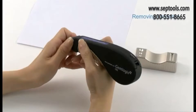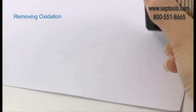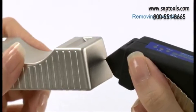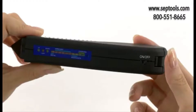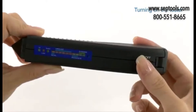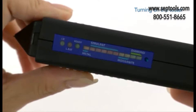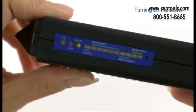To remove oxidation after long periods of storage, remove the protective cap. Gently clean the probe tip with a piece of paper or in a back and forth motion along the metal stone rest provided. To turn on the tester, press the on-off button once. Allow approximately 10 seconds for the initial warm-up process, during which a green light will flash continuously in the result window.